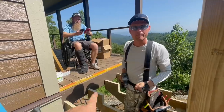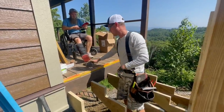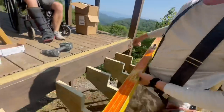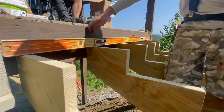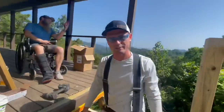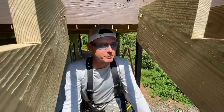Let's redo what you just did with the level — it's pretty important. Setting stringers: I drew a line, but it's really best to check to make sure these are perfectly level, that they don't rock or tip. Pro tip: check that they're all touching at the same time.